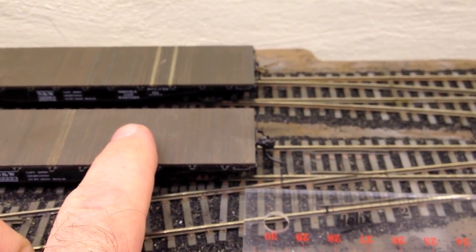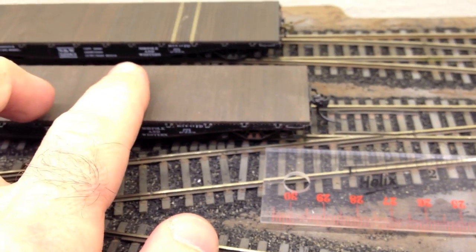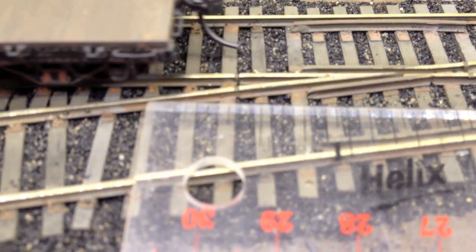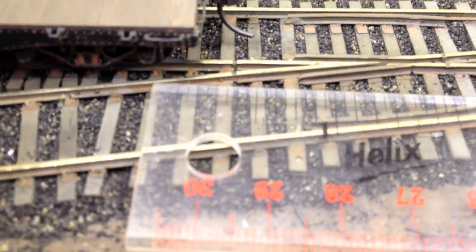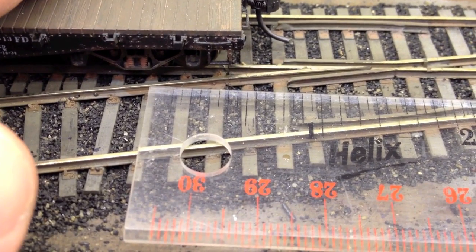When letting go, it first takes the compression out, making about an eighth of an inch. If I stretch it to full length — including a bit of slack in the drivetrain of the engine as well — it goes from zero, and I'm going to focus on that there, from zero at the pilot beam to about a half inch.